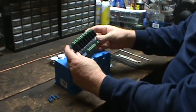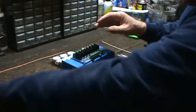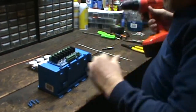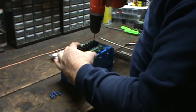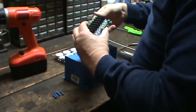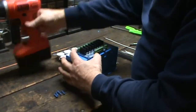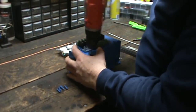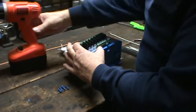The first thing we're going to do is attach the eight-channel relay right here onto the box. I'm going to center it on the box, drill a hole, and wallow the hole just a little bit - that makes it easier to get the screws in. I'll drop one in to hold it in place, then go over to the other side and do the same thing.